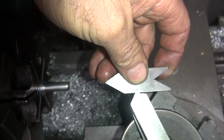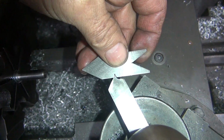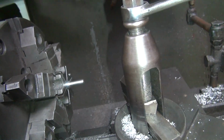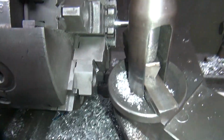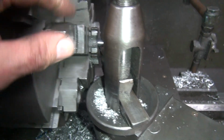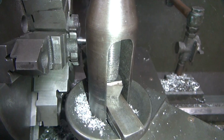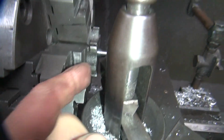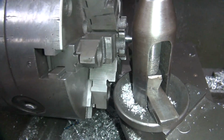So you see now I'm centered pretty even. I'm in parallel with my part here I'm going to cut. So we're on center that way. As long as my center height is close enough to cut on, I'm going to be good. So move that in, and I'm going to hit again because I moved everything. So see, I'm going to have interference issues. Basically, if I cut any more than that, I'm going to have some interference issues right here real quick.